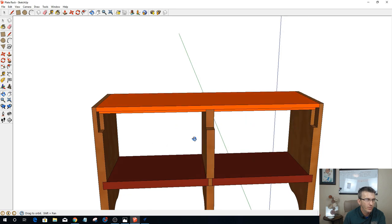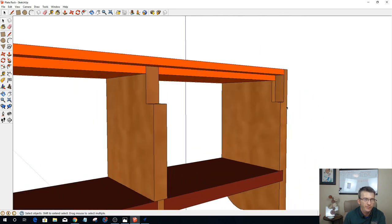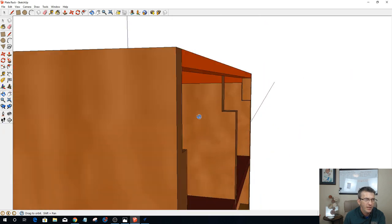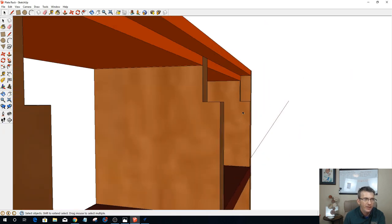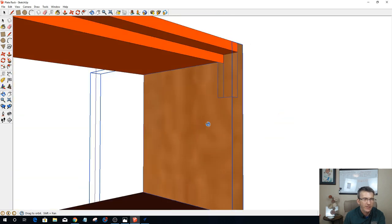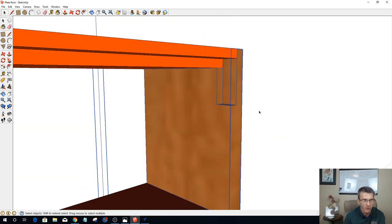Okay, so now we've just added in, we're going to have dog bone fillets on these inside corners on all three of these upper parts, but we've just added in the part on our top shelf. We've got another rabbet now that's going to be 3/4 inches wide that we've got to draw in Vectric. We've got another piece of joinery here, which is 1.5 inches tall. Let's get some measurements because I'm not going to re-import the files in. We're just going to go in and draw it.